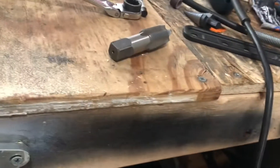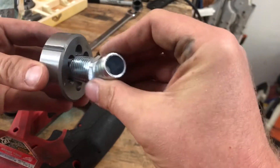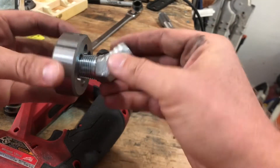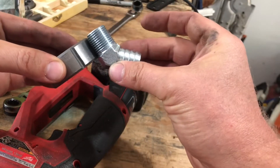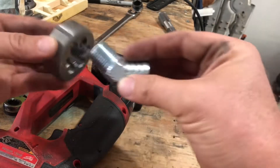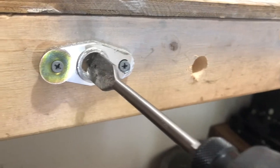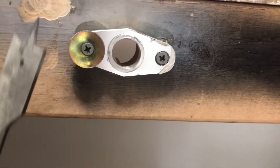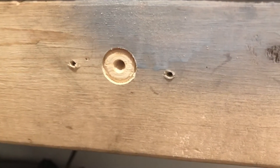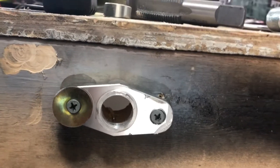It's just not gonna cut the metal out as well. I was also thinking about cutting off some of the threads on the elbow and re-threading that, but because of the tapered fit, even if I did cut them off I wouldn't be able to get the tap down far enough. I actually got it drilled out with a three-quarter inch drill bit — I moved it over and used the wood as a guide so I could use the center point of the bit. I'm gonna try and tap it out again and see if I can get the tap deeper.